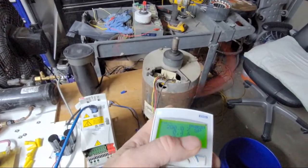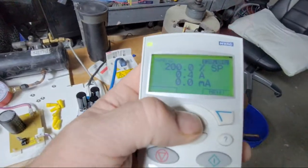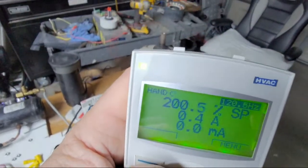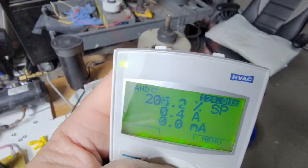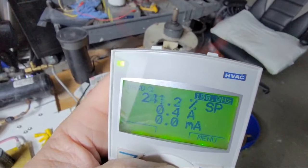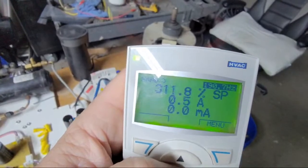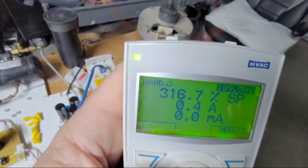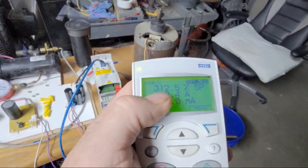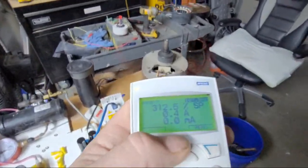The camera rate's making it look different. I can't even hardly see this thing with my naked eye, but the camera's kind of catching it, with the overlapping frame rates. So 120 hertz. This is ready to move, man. I know it freaks out. The motor actually, I'm going to show you in a second. Let me get it to 180, so just under 190. All right, so we're at 312% of nominal speed, which is 60 hertz. So we're at 187 hertz, right?